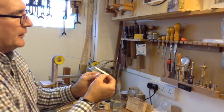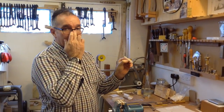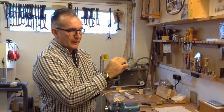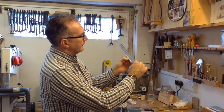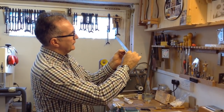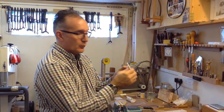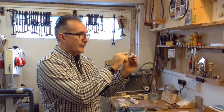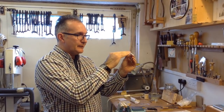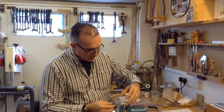I can see that I'm not quite on the line I marked yet, and that's on purpose. At the moment the top of the saddle is very straight — I can see it follows the edge of a ruler. But that's not what I want. I want a very, very slight camber so that the center section is very, very slightly higher than the ends. So that's what I'm going to do now.